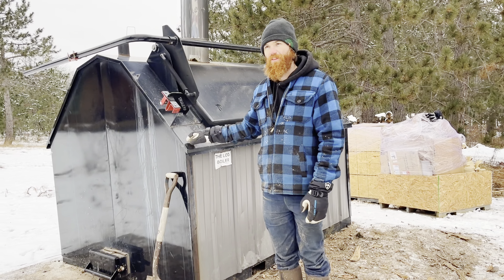The goal is hot coals - just like a normal wood stove, you don't need flame, you need hot coals. That's where your main heat storage is. The blower blows in through the grate underneath, and it transfers through a trough underneath that comes out the other side into the ash tray that you pull out. You pull this whole tray out and dump it - we use ashes in the garden, the chicken coop, and spread it on the driveway for melting ice.